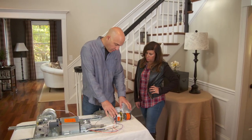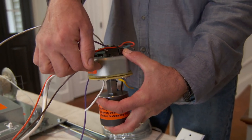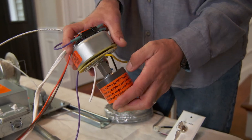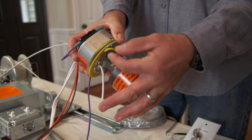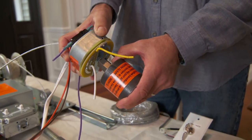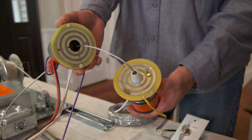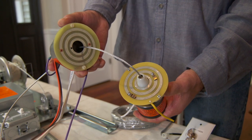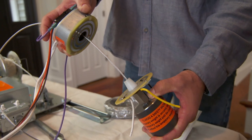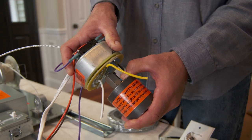First thing we need to do is remove the box that's up there right now. This box is going to replace the box you have in your ceiling. Normally this is where we make the connections from the wire to the light fixture, but here's where it all changes — the fixture gets mounted to the bottom of this plate. There's a green wire, a white wire, and a black wire. When you lower the fixture it breaks the connection at those three bands: one's your hot, one's your neutral, one's your ground.